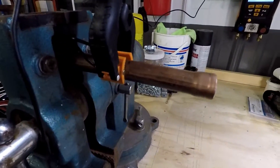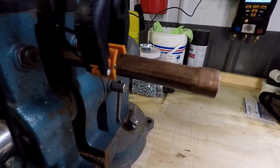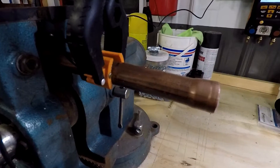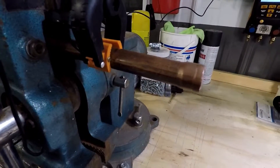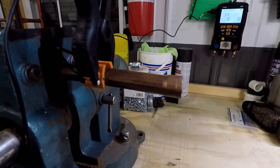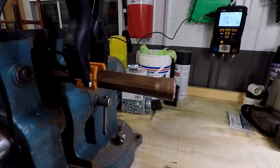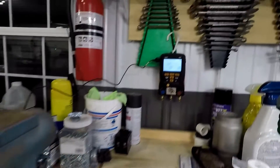I've actually taken a measurement off the Trane unit that we have here in the shop and put the clamp exactly where the body of the king valve would be. I already have it prepped and I have a piece of copper ready to go in. I'm going to start heating it up and let you guys watch the temperature gauge.